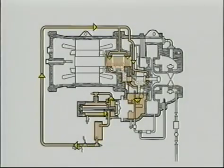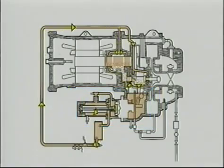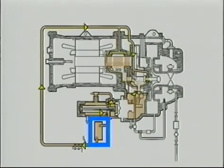Oil from the pump discharge passes through the oil pump motor and serves as a coolant. Oil pressure is regulated by a relief valve that's located internally. The valve relieves the pump discharge back into the oil sump, maintaining proper oil system pressure. Pressurized oil then passes from the pump motor housing and into the filter chamber via some external piping. After being filtered, the oil is piped to the external oil cooler.